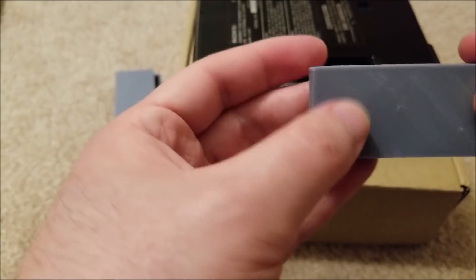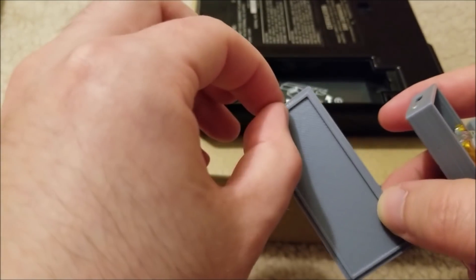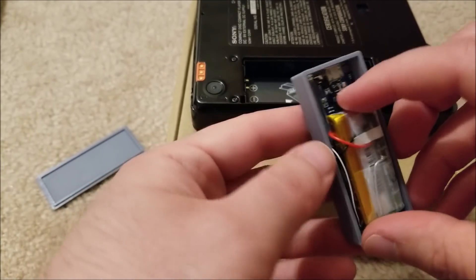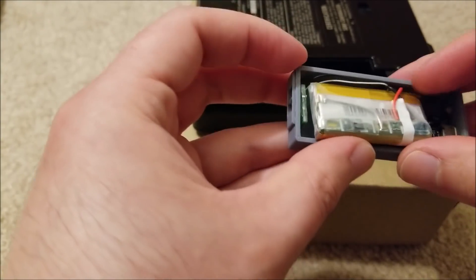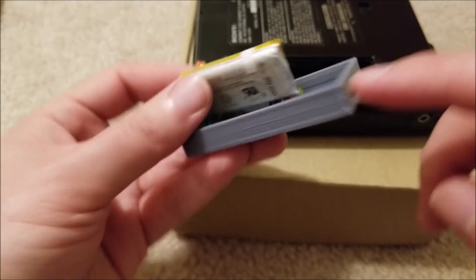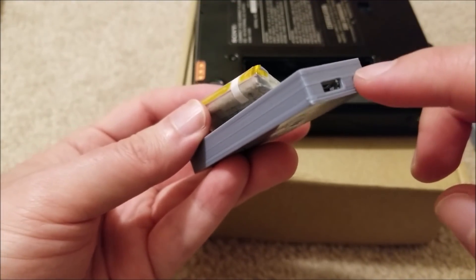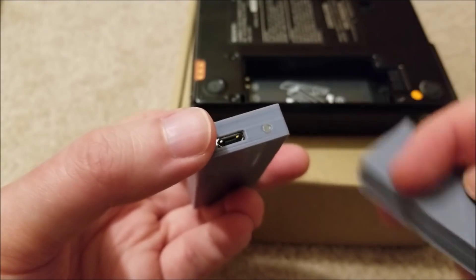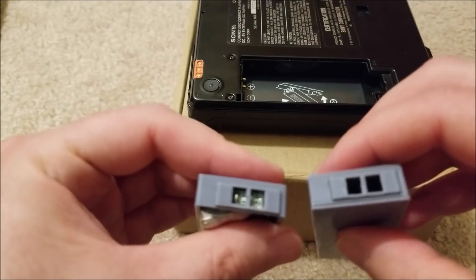So I modeled a second version with a cutout on the inner part so the clicking section is just a thin surround, allowing a slightly thicker battery to fit. This battery is actually from an iPod video — an old one I didn't need anymore. The circuit slides right in, the USB port is on the outside, and I had to rewire the LEDs using 30-gauge wire. I modeled a tiny hole, stuck a bit of clear filament in, melted the ends with a lighter, and pressed them flat with a piece of metal — essentially making a light pipe.